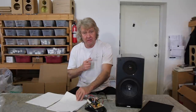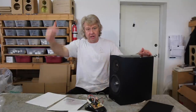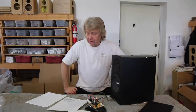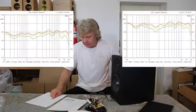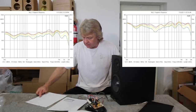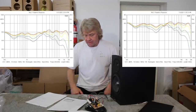What was really good about this speaker is the vertical off-axis. As you start going up and down, the drivers stayed in phase over a really wide range and maintained a really even response. If you look at the before and after, you'll notice it's about the same in that regard — it hardly changed at all. Same with the horizontal off-axis: before and after look about the same.